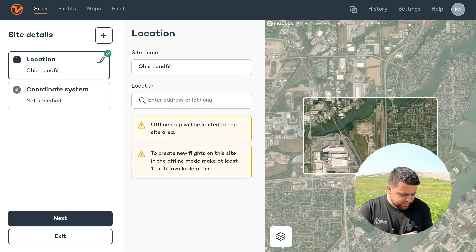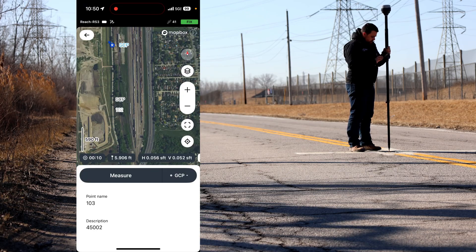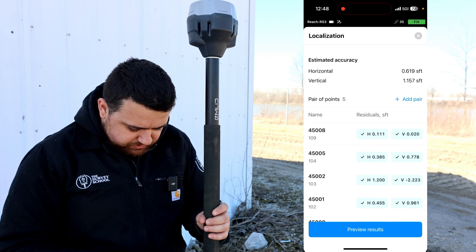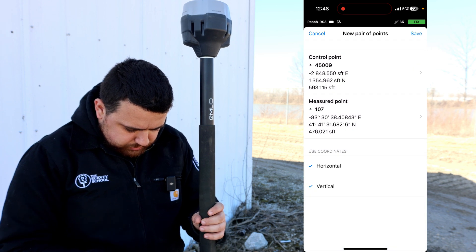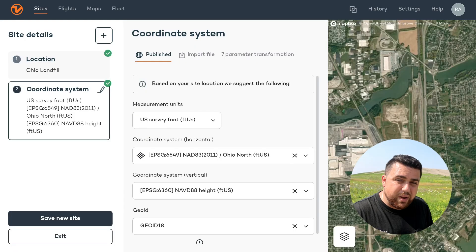I can put an address, but I don't have to. Next I'm going to go to coordinate systems and I could select a predetermined coordinate system — for most of you, this is the option you're going to pick. However, I was actually on this site in early spring. We did a local control survey using Emlid Flow and I localized all of these state plane coordinates to a local coordinate system that our client provided to us. Most of you are probably just going to use state plane coordinates, and here it says NAD 83 Ohio North, which is the correct state plane coordinate system. My client is requesting this in a local coordinate system, so I'm going to show you how you can get the data off of Emlid Flow and input it into Wingtra Cloud to localize your survey.